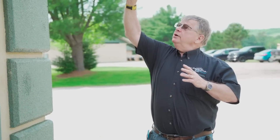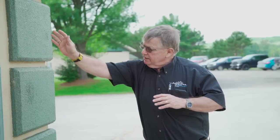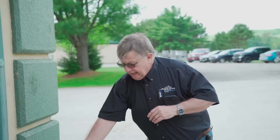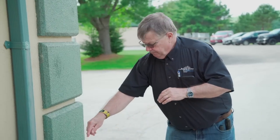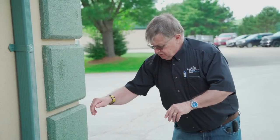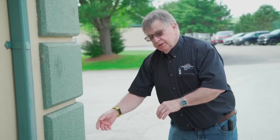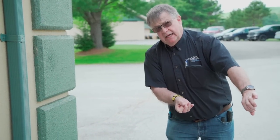And we're often asked, how do we freeze protect this? Obviously, one way is when you're doing your roof and gutter, you're protecting your gutters, and then you're going to run your heating cable down the downspout, and you can continue it right into the drain. Now, if it's a long drain, you can use a fish tape. You can insert a fish tape and pull a rope through it so that after you can draw the heating cable into the drain to protect it.